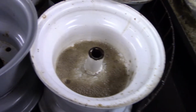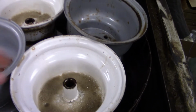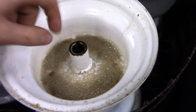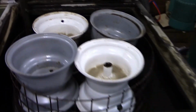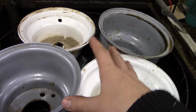If I would have had the time, I probably would have gotten actual hubs that can have set screws, put some set screws on it, and then bolt the wheel to it on a 3/4" shaft, because that would work a lot better than having keys, because they tend to crack and are not the strongest. But if I have some time later on, I might convert to that. I'll go ahead and sand these down just to get the paint scuffed up. I'm going to paint them gloss black.